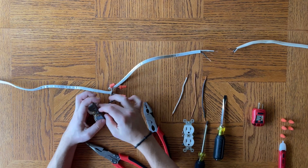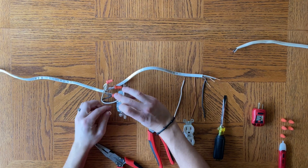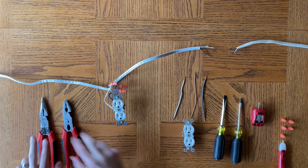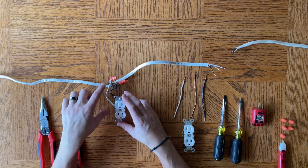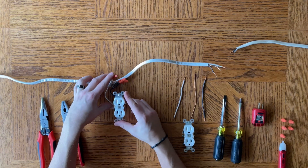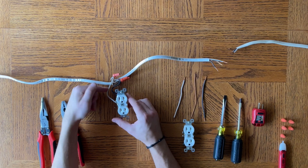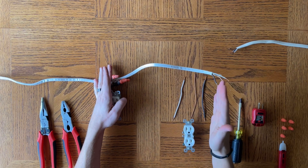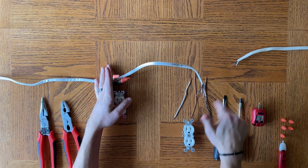If you need any of these tools, feel free to use the product links in the description below. At this point you would now have one working outlet. These wires should be longer — I personally like at least six to eight inches — but this is for demonstrative purposes; I did it smaller to fit in the frame. All of this would be in your outlet box. If you have wires ten inches long, it may be too much to fit in an outlet box, so be aware of that. This all goes in your single gang outlet in the wall, and then the wire behind your sheetrock connects to your next outlet or box.